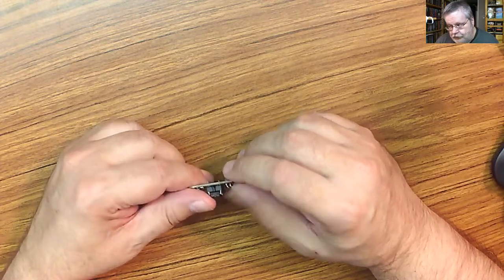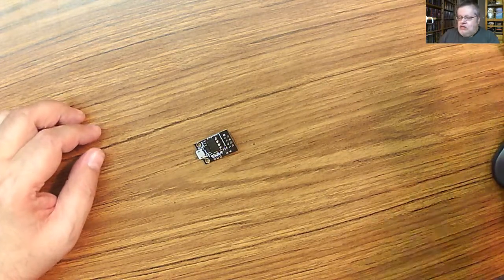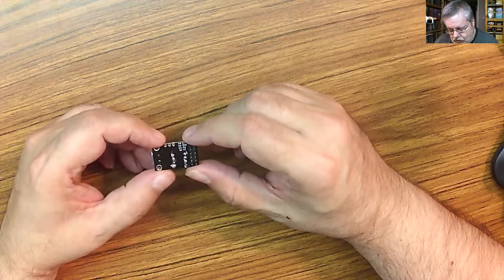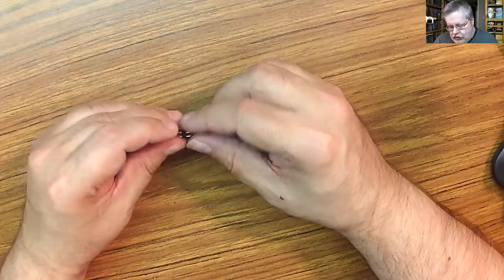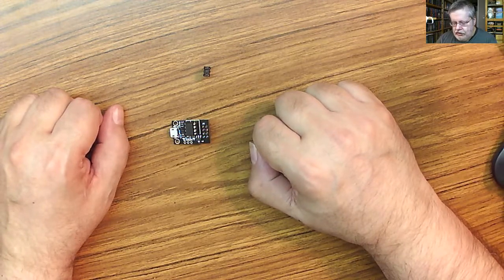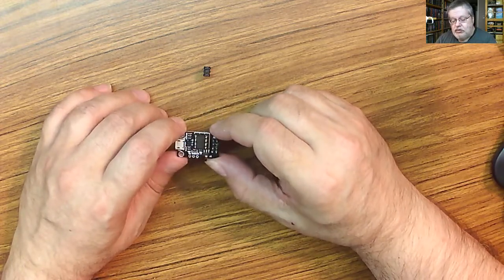So we're going to fix this with a desoldering system. So I have to wait for it to heat up for a sec. Takes about a minute. And I will desolder everything. These pins right here. Now, I didn't realize it, but I actually had this for the board. So I'm going to put it back in. 244 degrees, still climbing. We're in Canada, so it's Celsius. I'm aiming for 375 degrees.